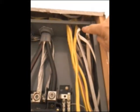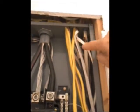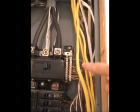We're looking up inside the panel. There are no bushings on these wires, and we have too many wires coming through the same openings — this is unprofessional wiring. Also, all of this insulation should have been peeled back. Again, unprofessional.